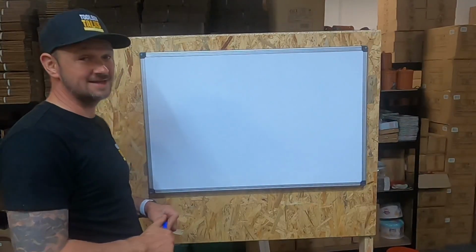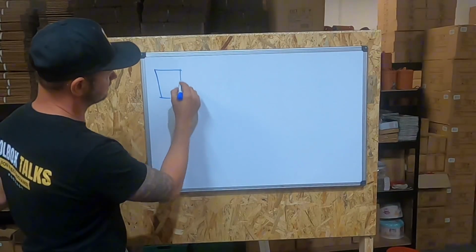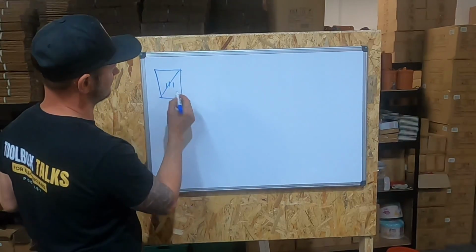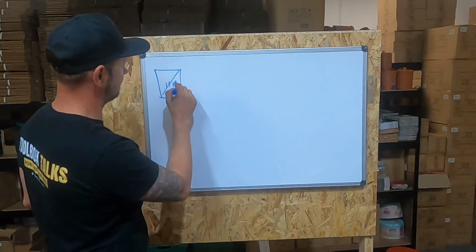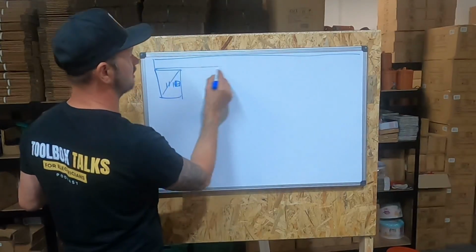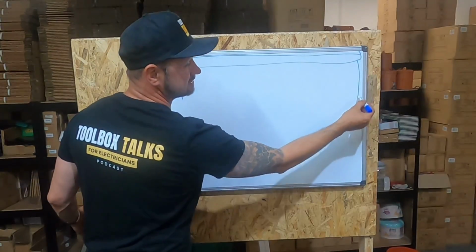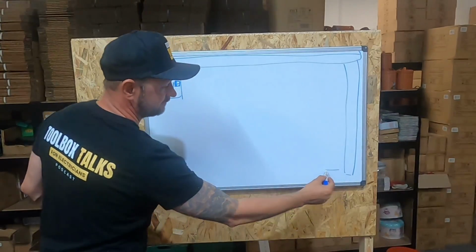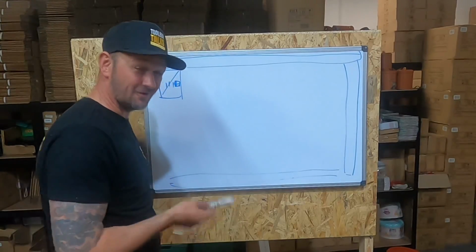Right, so the plan is, basically I'll draw out on here, we're going to put the board up here, which is going to be a little Luden 4-way board with our main isolator in there. And then we'll have plastic trunking, 4-inch trunking going all the way across to here, with galvanised trunking coming down here. Then out of that trunking, we're going to have some cable tray. So all sorts of containment are going to go on here.